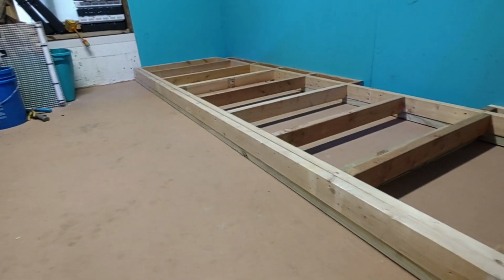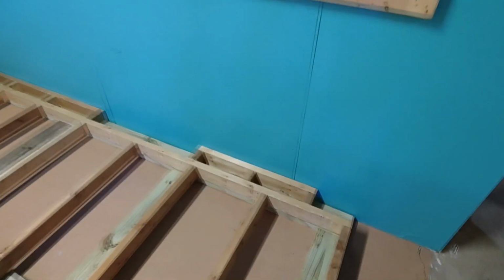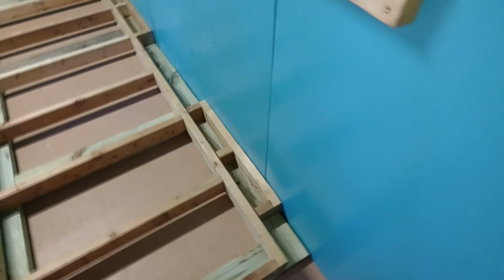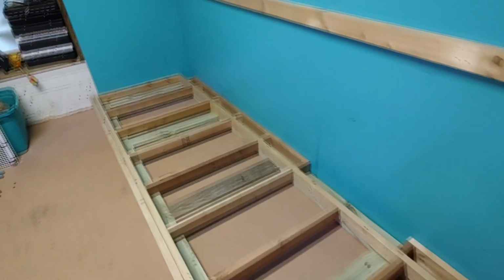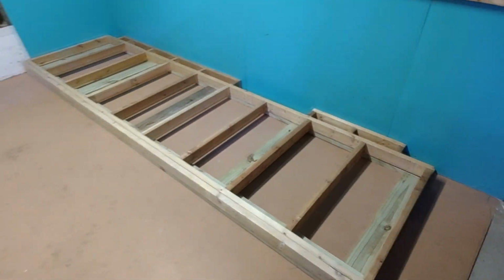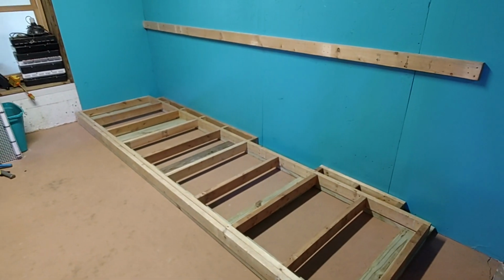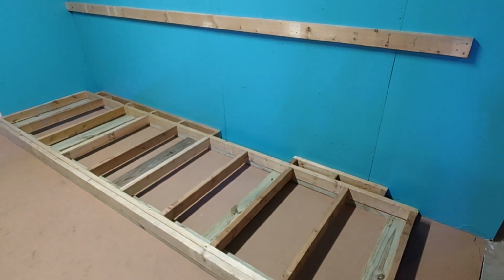The top now has been built. Everything there is 16 center. I went ahead and sistered up the two front 2x4s. And in the back, we've got our little spacers, I guess we'll call it, because this is definitely an unconventional build here. This is not like a typical stand. It's definitely custom, so don't do what I'm doing. There's a lot of different ways to build a stand, but this one is kind of an as-build, and it'll make more sense as it comes together because of so many different things that are going on with this particular stand.